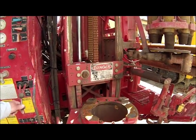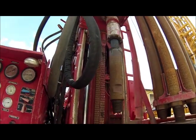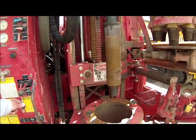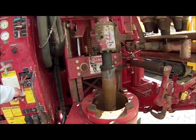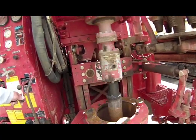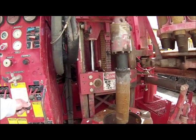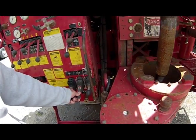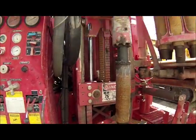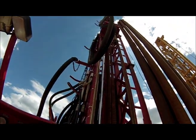Lower drive all the way to the bottom. Carousel clearance to come in. This will be when you change your drill rod. It goes plenty far enough through the table. Now to switch from lower drive to fast feed, you hit that toggle switch right there, and the fast feed head goes up. Works excellent.